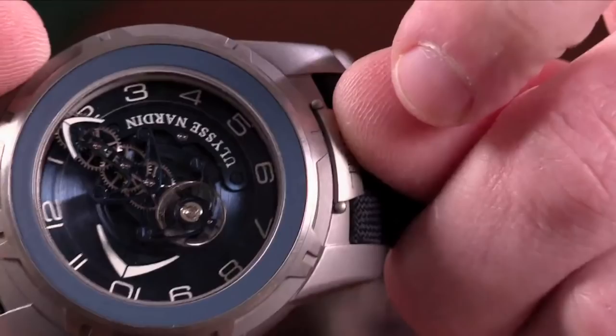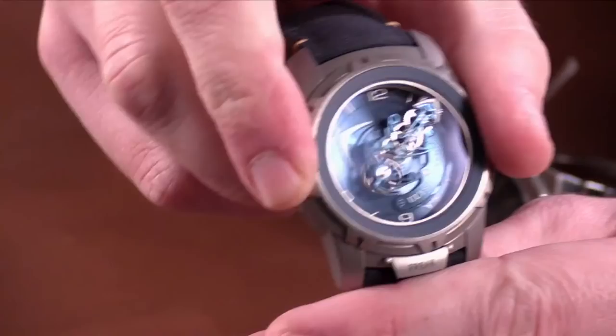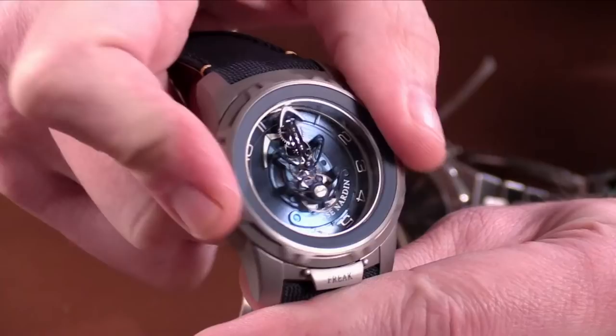The regulator is like a tourbillon in some regards, except there is a separate power source driving the rotation of the carousel and the escapement, which is why you can move the carousel using it as the minute hand without crashing the escapement. If it were just one drive train as with a tourbillon, the combination of a single drive for both the regulator and the carriage would cause the lever to crash. There is a little lock at the base of the dial — you lift that up and use the bezel to set the watch. The whole carousel moves as the minute hand, superimposed over the hour hand.